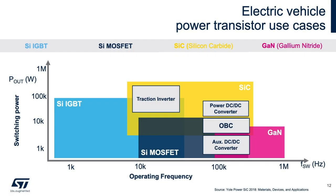A bulk of the conversion from AC to high voltage DC is performed by the DC-DC converter block. All of this comes with the need to connect, monitor, control, and manage power. Specific operational parameters for each vehicle system largely determine which transistors and switch technology is most suitable. These use cases, for example the onboard charger, have requirements that dictate how much power needs to be switched as well as transistor switching speeds.